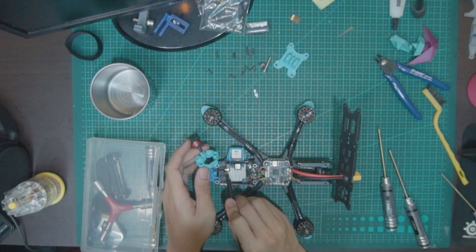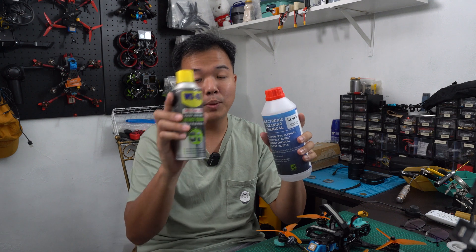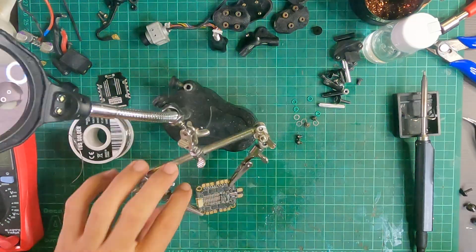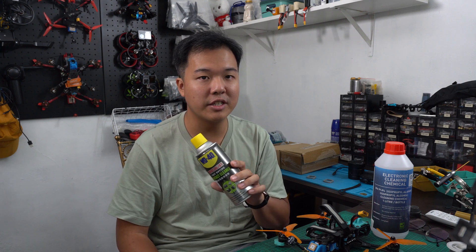After a little while of drying, start removing things — remove the props, remove all the screws, try to unwire everything from the circuit board. During this teardown process, your two best friends are isopropyl alcohol and electronic contact cleaner. Be very generous spraying the contact cleaner and isopropyl alcohol onto it, then use a brush to scrub the electronics. The contact cleaner gets dirt and junk out while the isopropyl alcohol cleans and also evaporates away water that can't be seen with the naked eye within the components.